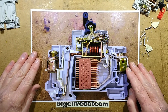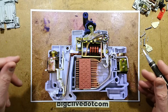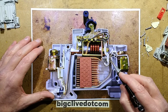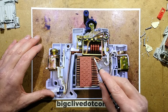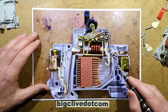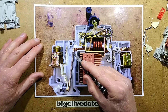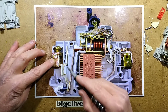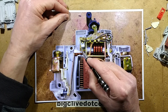Here's a close-up of the circuit breaker to see the components in detail. Mains comes into the breaker from one side - in a distribution board it would come in from the bottom. The first contact is a small plate and the second is a hook-shaped contact, which when it trips forms part of an arc chute with a piece of metal to deflect the arc up through the quenching plates. There are two trip mechanisms: a bimetallic strip, and a solenoid. The current flows through a coarse solenoid and then up through the bimetallic strip - you can see the two layers, copper on one side - up to the other terminal, with an adjustment screw to fine-tune the bimetallic strip.